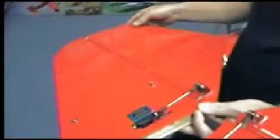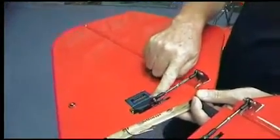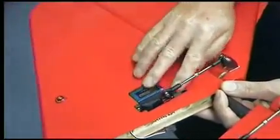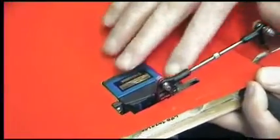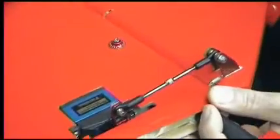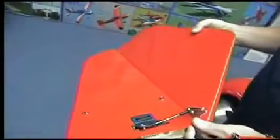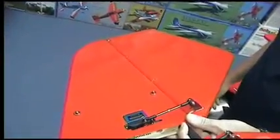These, as I said before, are 31 kilos each and operating on a 1-inch arm, so they're quite short. If you're intending to do enormous 3D and you want enormous deflections, you may want to look at something slightly different, but in my case, where I'm running a pretty good deflection, that's more than enough for me. The plane's quite active at that. 1-inch arm is more than suitable.